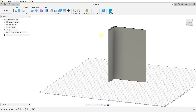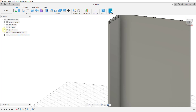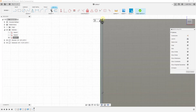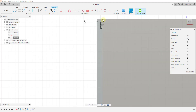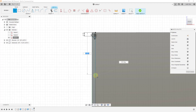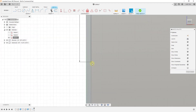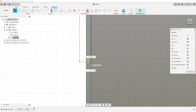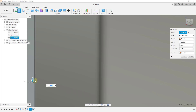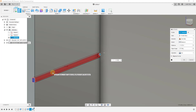Now I want to do the same thing for the fixed shelf, going down about 15 and three-eighths of an inch. You can either create a new sketch, or turn this sketch back on by going into your sketches, clicking the eye, then right-clicking and clicking edit sketch. This is where my fixed shelf is going to go — about 15 inches down. I'll draw a line down 15 inches, then draw a quarter inch deep, three-eighths of an inch long recess, click finish sketch, and extrude by negative 11.25 to remove the material.